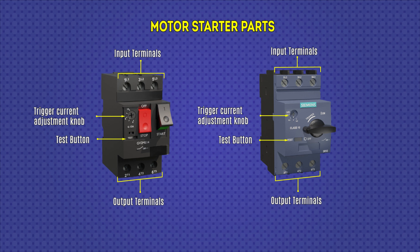What differs between the two models is the buttons and knobs used to put the engine into service. In the model on the left, it consists of interlocked push buttons — when you press start, the stop button rises and vice versa. In the model on the right, the knob must be turned clockwise to on. When a fault is detected, the knob automatically turns to the center position indicating a fault. To enable it again, it must be turned to off and then back to on.